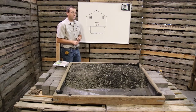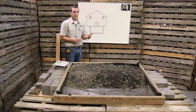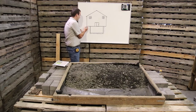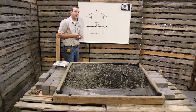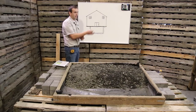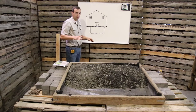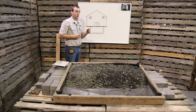Now we can go on to step three: get it square. Making a square line really helps most when you're laying the paving stones, but it also helps avoid under-digging or over-digging during excavation. If you're working off a foundation, take a couple of wooden or metal stakes and put them on each end of your foundation, just outside of it. Then stretch a line across. In order to establish square, first make a straight reference — you want to lay your paving stones straight with your house. Move that string as close as you can to your concrete foundation without touching it, because no foundation is perfectly straight.